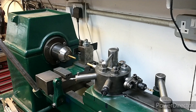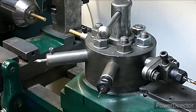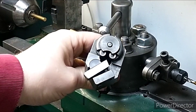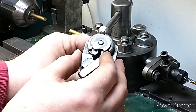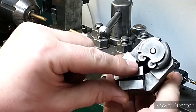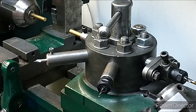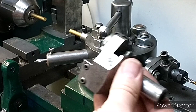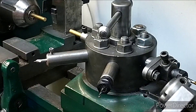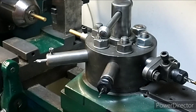You don't need much skill to operate the machine — all of the skill is in the setting up of the tools and deciding the order of operations, which was traditionally the job of a tool setter. I'm not showing it here, but there are tools that can do turning as well. For instance, this is a roller box — it has rollers to support the back of the work and a tangential tool at the end. You feed that in from the end and because all the load is supported you can make quite heavy cuts.